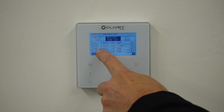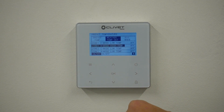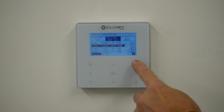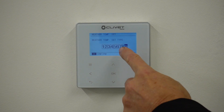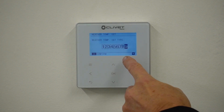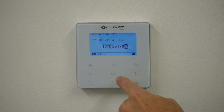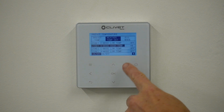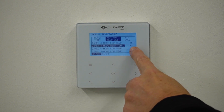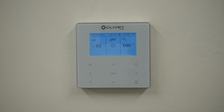Under preset temperatures we have preset temp, weather temp set, and eco mode. I'm going to go to weather temp set. We have to turn zone one H mode high temp to ON — pressing the on/off button, it will ask what weather curve number you require. We're going to use number nine, because nine is our own custom weather settings that we've just put in. Click OK, that's now on, and the unit is now in weather compensation mode.